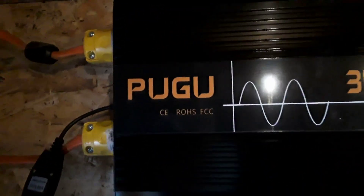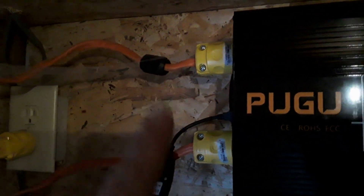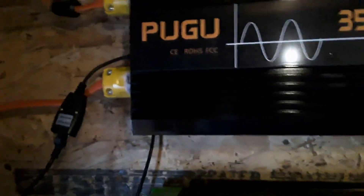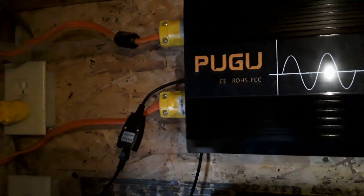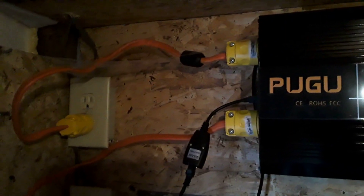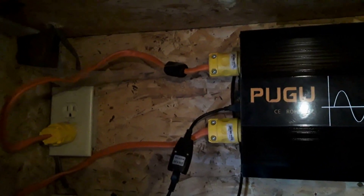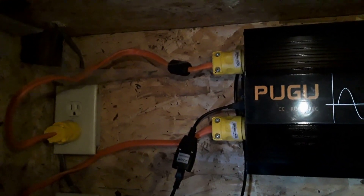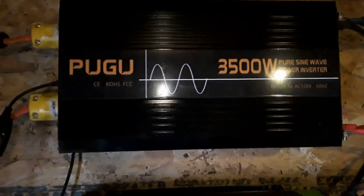One thing I don't see a lot of people doing is putting on noise filters. I did notice it helped a lot — some devices were either humming or not performing quite as well. I put a ferrite magnet over the cable and it seemed to reduce the humming or noise. I don't think all inverters do that, but in the case of modified sine wave or even some cheaper pure sine wave inverters, they can.